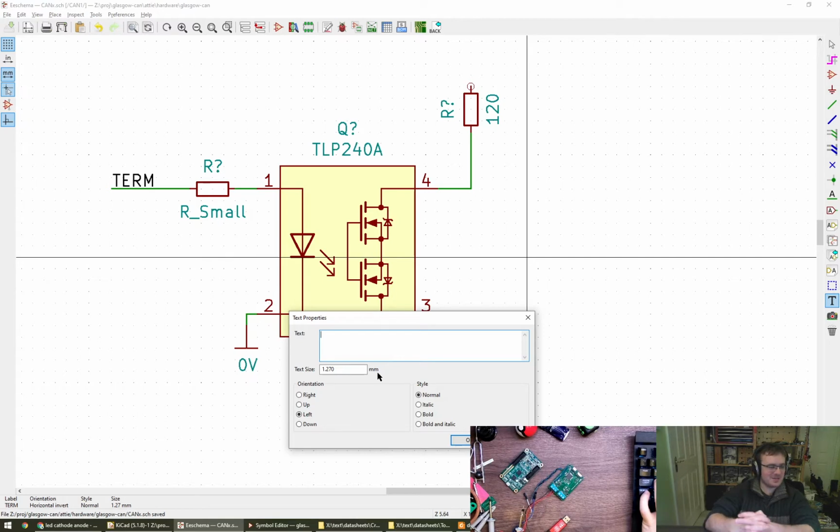With optos, I'm always nervous because you can't see them working. And if you don't give them enough, does the FET start to not conduct properly, etc. I don't have a good handle on that one. 15 for safety. Let's go for 15. So I equals 15 milliamps, V equals 5 volts, which means that R equals what?